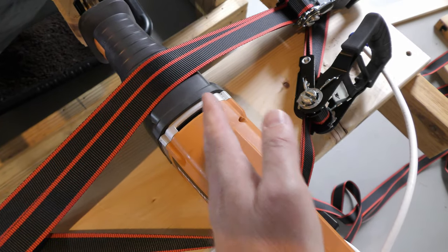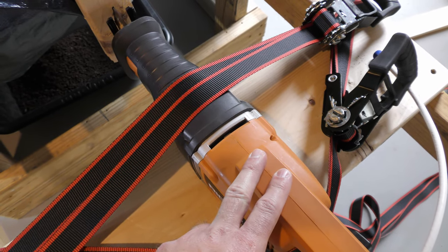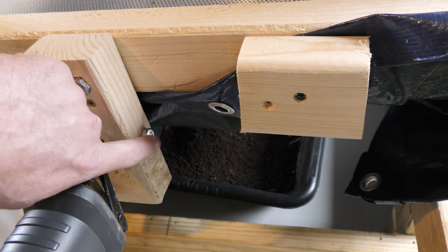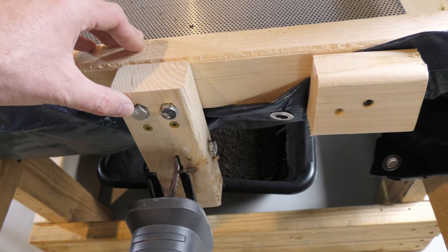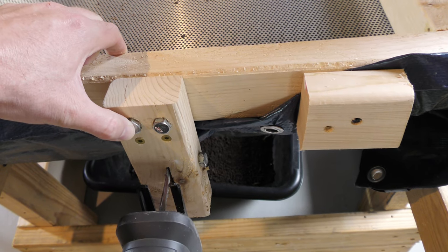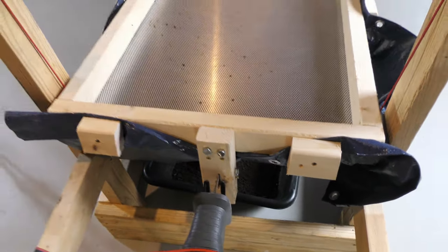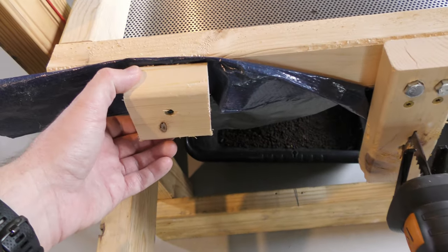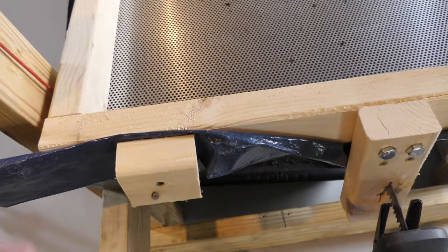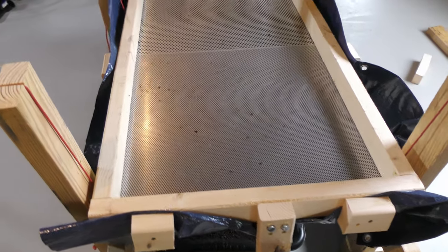The reason I don't have boards fully enclosing the sawzall mount is that I don't know if I'll have to replace it or want to keep this setup - it was my first idea, as I've seen other people do it in videos. I have the blade anchored in place by drilling a hole through it and running a bolt through the blade. The attachment piece originally held on with deck screws started cracking and ripping apart, so I had to use bigger bolts and kept the screws underneath for more support. For the tarp, I didn't just screw it in directly - I put wood blocks over it so it would have more support and wouldn't rip apart at a single point.